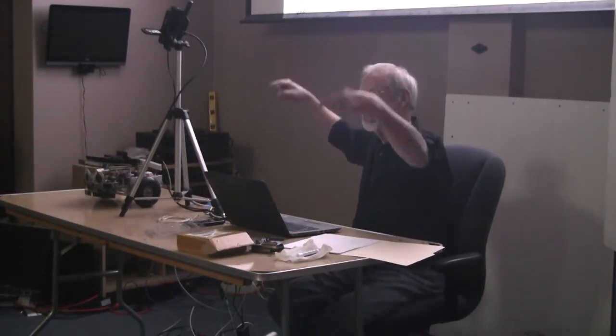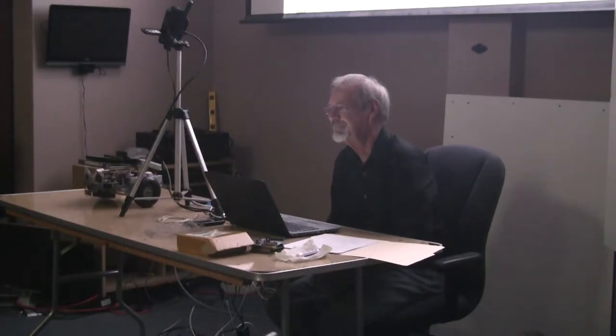You can read a single port and increment through memory the values of that port, or you can increment the port at the same time you increment memory. There's just lots of things. It's very flexible. It's really good for the UART too, because you can just say, send all this over here to this UART, and it takes care of it.